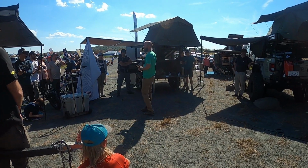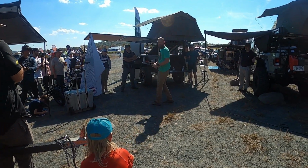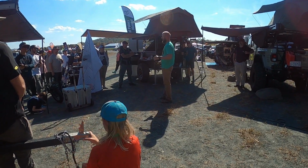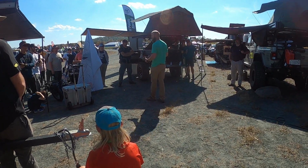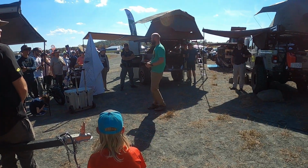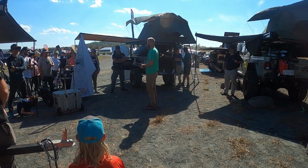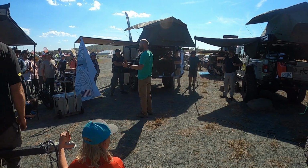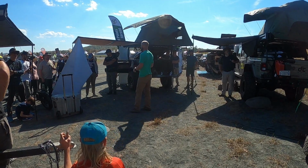Once we feel good about the hitch and that it's going to hold, then we can start looking at getting into rigging, okay? Now, good chance if you're by yourself that you may not be able to slow this trailer down 100% as it comes down. So as we're doing the rigging and this trailer is secured, think about getting things out of there that are breakable or that you might want to protect, okay? Maybe you've got a nice expensive battery in there or a fridge in there. Those are good things to get out of that trailer if you can access it. This is also why I don't necessarily advocate keeping your recovery gear in your trailer, because now you've got to get your recovery gear out and secure the trailer, okay?